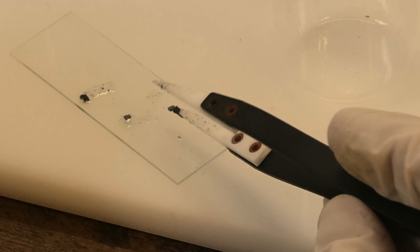At the end of this, you get the die, and you clean it off in isopropyl alcohol and acetone. You do not mix the isopropyl alcohol and the red fuming nitric acid — does anyone know why? It's rocket fuel. If you do it in very small quantities, it just does a little pop. I've never tried it in large quantities because I don't have a death wish.